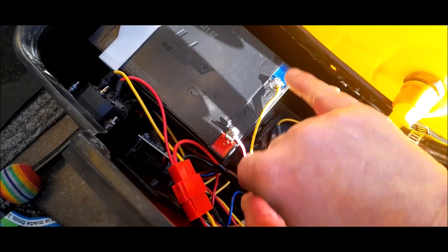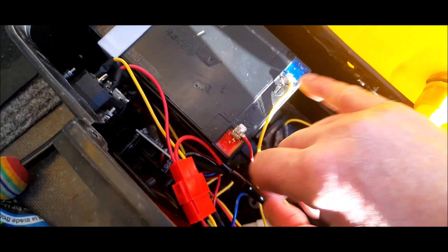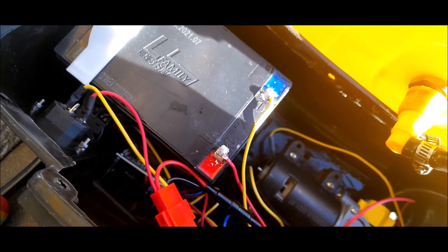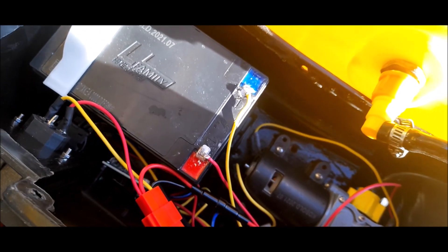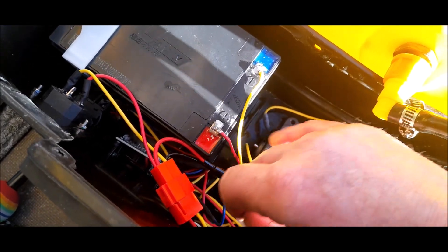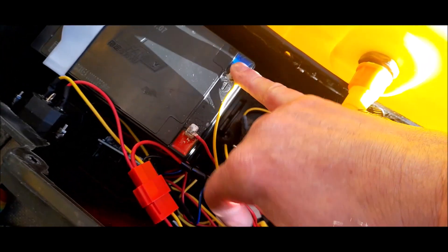I would personally recommend — and I'm going to do this myself later today — desolder the wires onto the battery, reflow the solder, vacuum the solder off the battery contacts, ensure they're clean, use a very small file to clean them up, and then use some push-on insulated female spade connectors and hot glue those. I don't trust these connections as they may be subjected to corrosion pretty quickly if you're not careful.